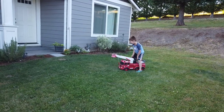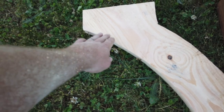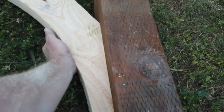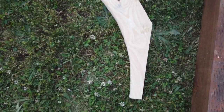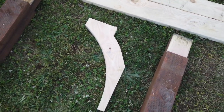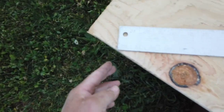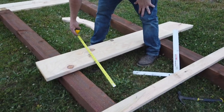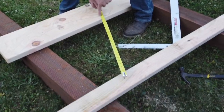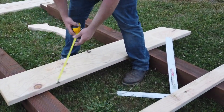The next step in the process for building this garden arbor is the braces, which have a little curvature to them. They'll brace down like that and then go up and screw into the top part. To cut those out of a two-by-ten, take your framing square and line it up so both corners touch. Throw a nail in 20 inches from your board, hook your tape measure on it, pencil on 24, run it across and put a mark. Then go back to the center, put it on 29, go across and make a pencil mark — that gives you your two arches.